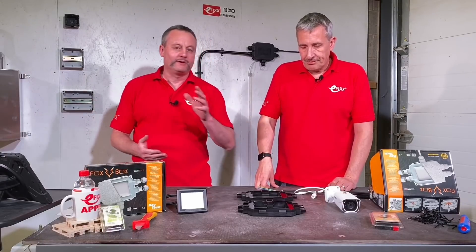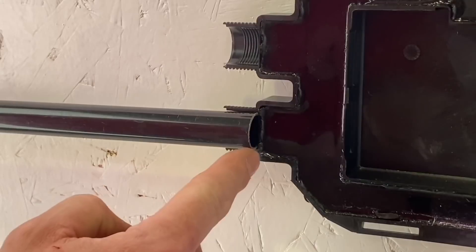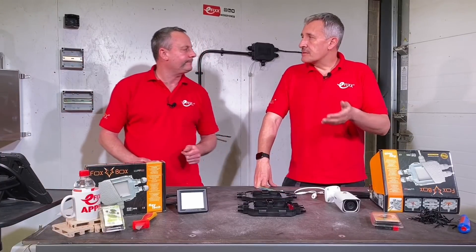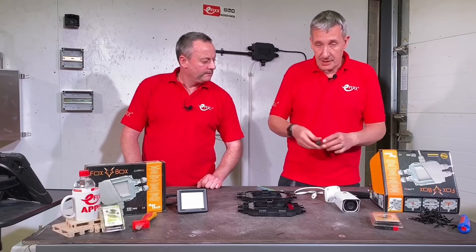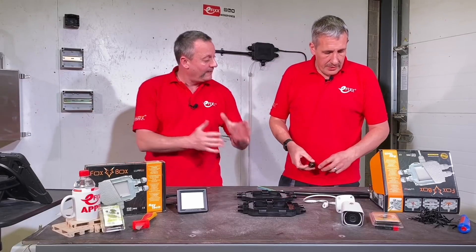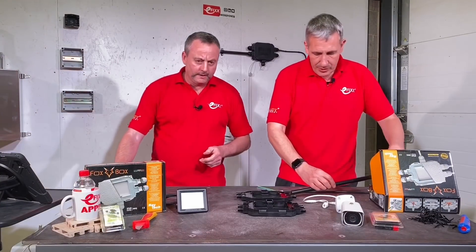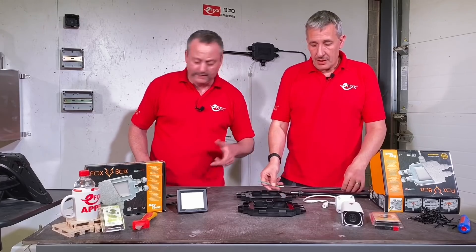There are different ways of moving in through the seal depending on whether you're bringing in a conduit or a cable. Let's start with the conduit - the conduit is just cut and butted up to the section, which will need to be split later for the cables. The key thing is: top tip - put that lock ring on first. You don't need to add any additional glanding to the box as you would with a normal enclosure, where you'd add a stuffing gland or conduit adapter. These you bring the conduit in and seal it with the lock ring. It will accommodate 16mm, 20mm, and 32mm conduit depending on the adapter - at 20mm you don't need an adapter.